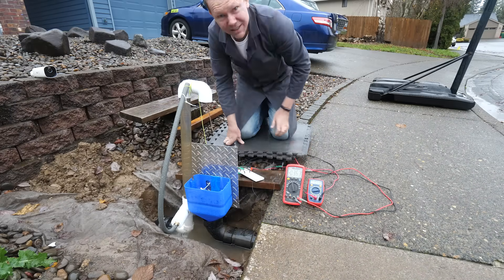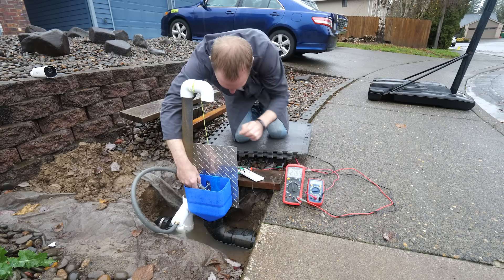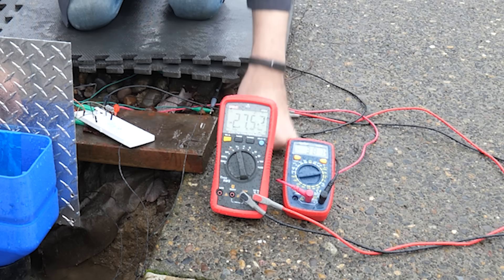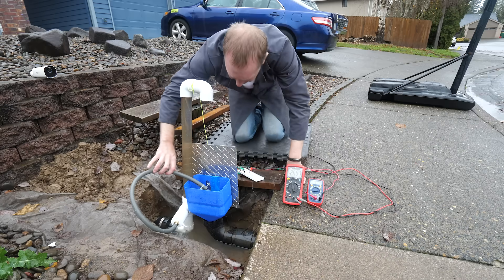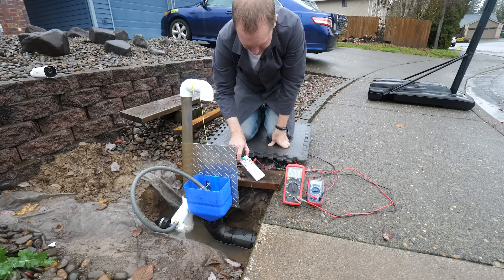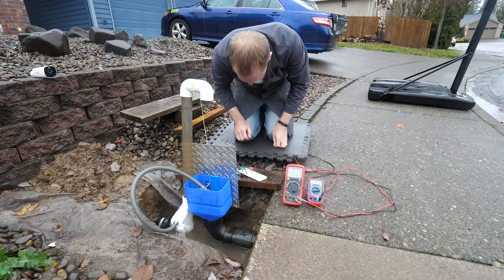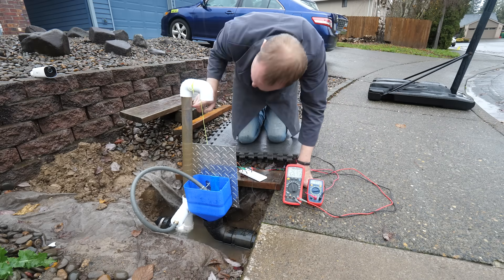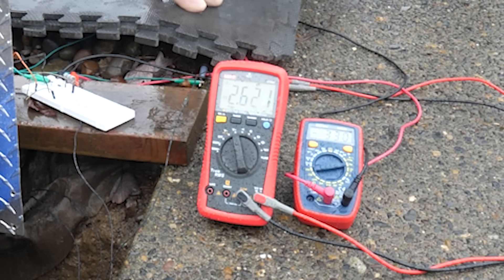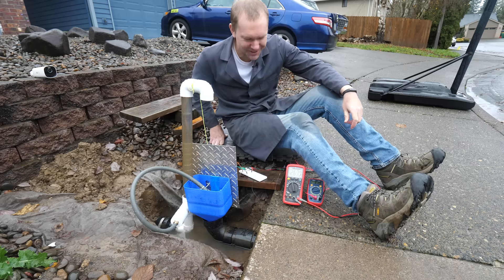Hey, there it goes — that must mean it's ready. Let's do this. Aw yeah! While I'm holding that, what are we getting? 2.74 volts and almost 4 milliamps — 3.8, 3.7. That works. Those LEDs are nice and bright. I've got my polarity right on those things — it wouldn't work otherwise. Water level is down to here: 2.6 volts, 3.38 milliamps. Obviously, that is a pathetic amount of power coming out of this thing, but there are a lot of things we can improve about this setup.